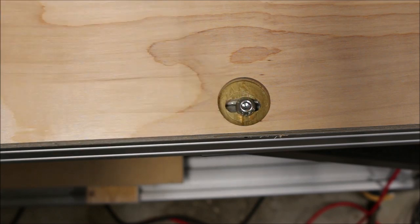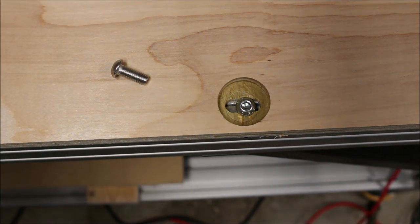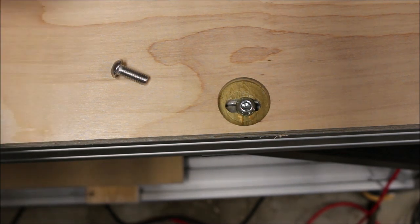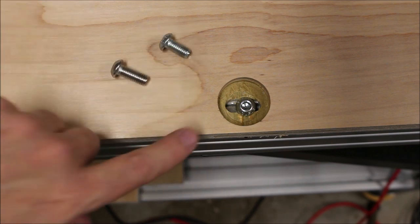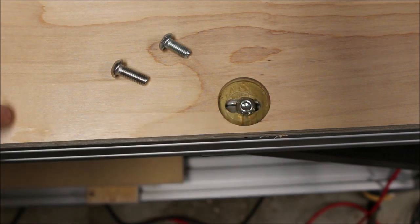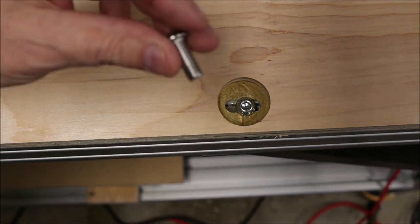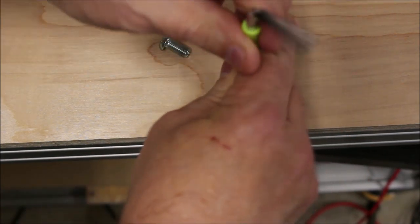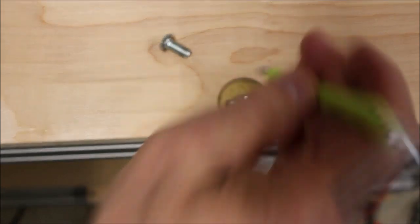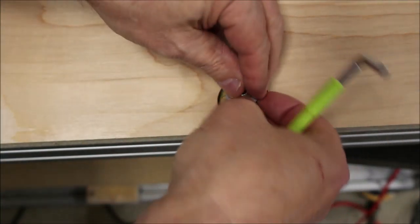I'm not crazy about this. The screws included in the spoil board fastener kit are M8 by 16 millimeter, and they're so short that by the time you start cranking down on it, it almost looks like it could pull through that slot. And since it's so short, you can't put a washer on the other side because then it's not long enough to reach. So I got online and ordered some 20 millimeter screws so that I can add a washer and feel like I can get this thing fastened a whole lot more securely.